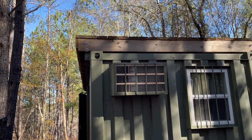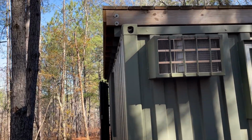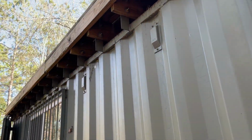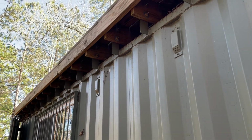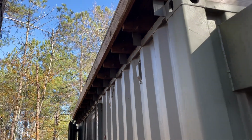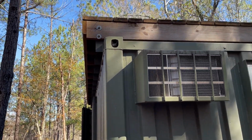And then once we got the C-clamp up there on each side, we drilled through the wood. And then we used the impact to put our hardware in. And those are 3/8-inch bolts that are grade 8, zinc plated, and they have nylock nuts. So they are not going anywhere. And they are torqued down pretty good. So we were very happy with that.